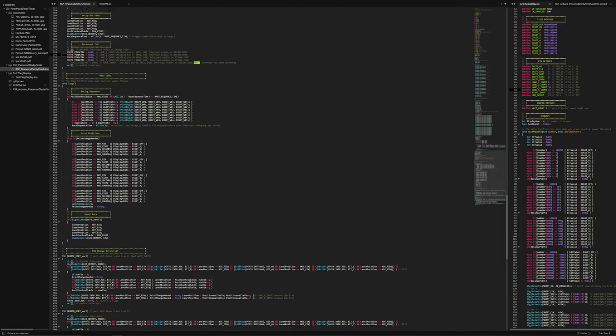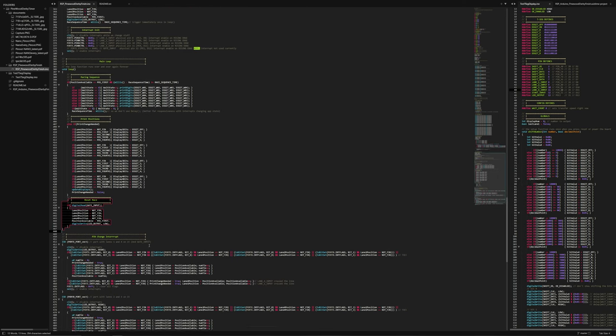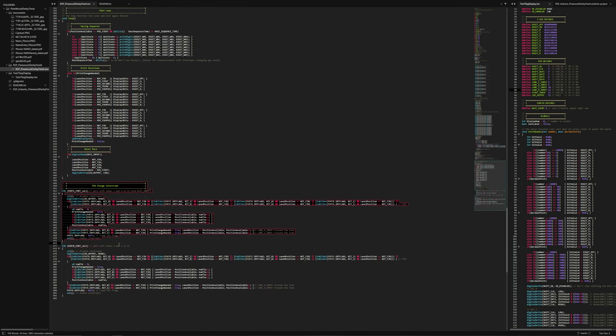And now we get into the main loop, where essentially two things will happen. Either we're waiting for someone to finish and we're doing our fun little light show here, or someone has finished and we update their position on the displays, and you can reset for a new race using the gate input right now. And as for my interrupts for the pin change, essentially what happens is that if someone crosses the finish line and they haven't been awarded a finish position, then there's a global variable that holds what position is available.